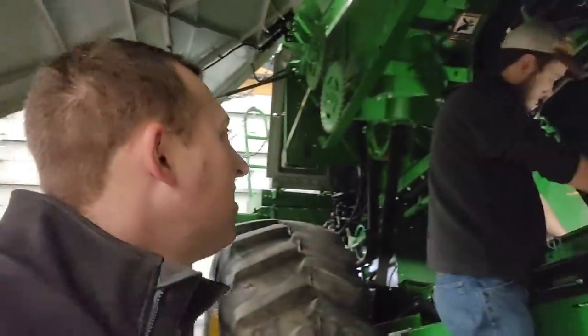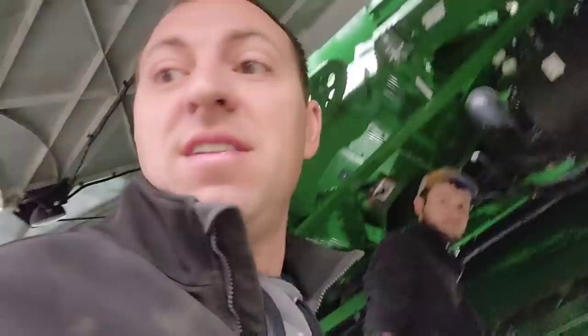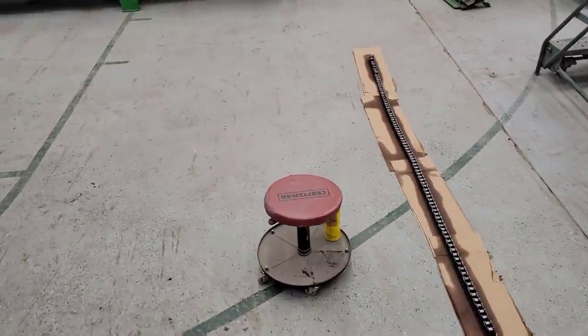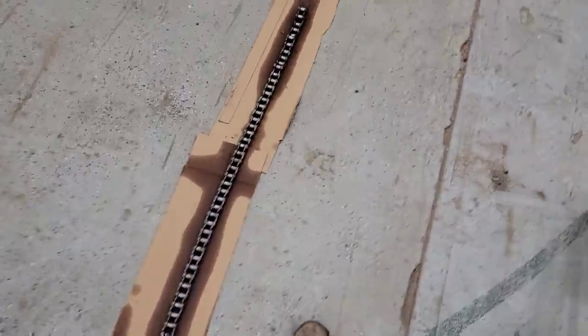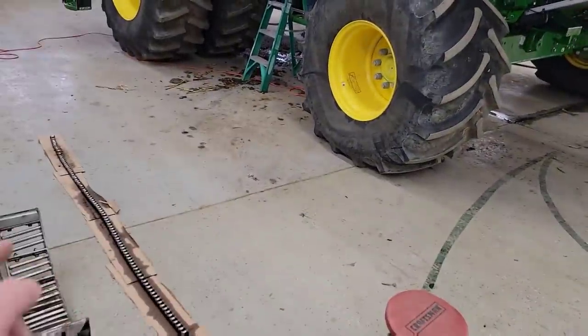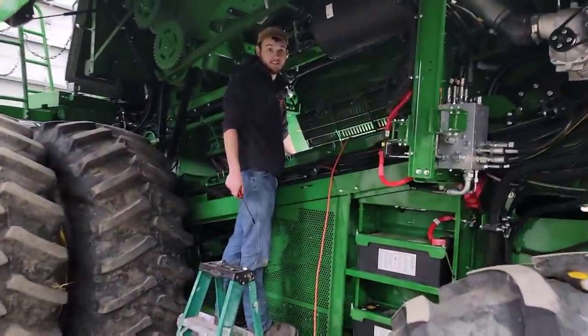Let's see how Brock's doing. He's trying to get water out — good. He cleaned up our chain, kind of sort of — still got a ways to go, lot of kinks in it. The idea is to spray it down, get it cleaned up, and then try to lube it up. You might want some WD-40 or even some diesel fuel to dissolve the crap out of it and then lube it.